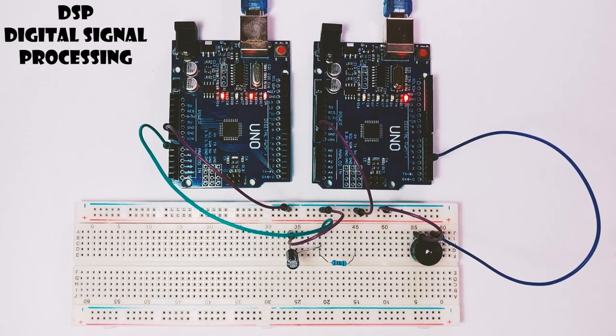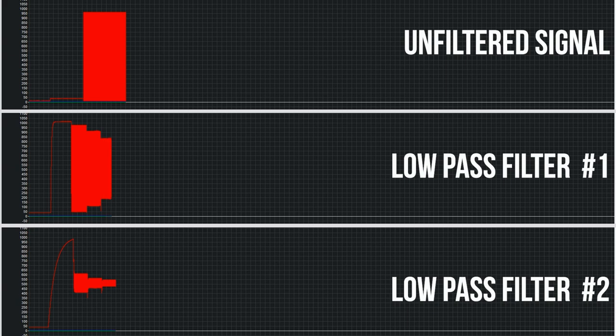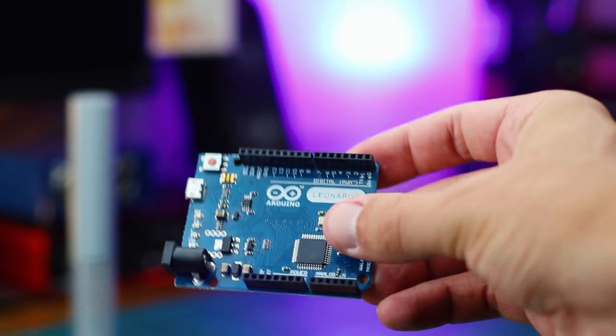We should also remember that it is not a high output transformer because it's much harder to add more wraps manually using a thinner copper to keep the 1 to 36 ratio between the primary and secondary windings like the premade Lundahl transformer has. This is essentially how the voltage generated by the moving ribbon is increased. During that same university course, I had a few projects using an Arduino as a DSP device, so I think an audio interface is basically a fancy voltmeter for sampling voltages, just like the Arduino input pins. Anyway, it should be enough for loud sound sources like guitar amps, violins, trumpets, and most of what ribbon mics are usually used for, especially if you use it with a booster.